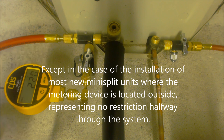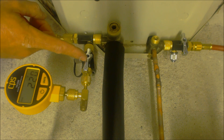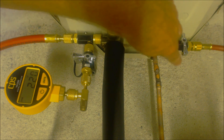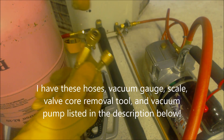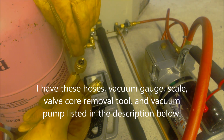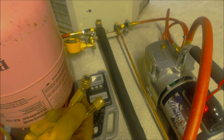It held for about 7 minutes now, and we're going to go ahead and weigh in the liquid refrigerant into the liquid side. First we shut off our micron gauge. These Apion valve core removal tools are actually vacuum rated down to 20 microns. So we're going to go ahead and disconnect our micron gauge. Now we're going to weigh liquid refrigerant into the liquid side. It's worth mentioning that these two vacuum hoses do not have valve core depressors in them — that would restrict the flow of the vacuum. Now we're going to attach this hose, which has to have a valve core depressor onto the Schrader valve. We're still not attaching into our manifold set yet.